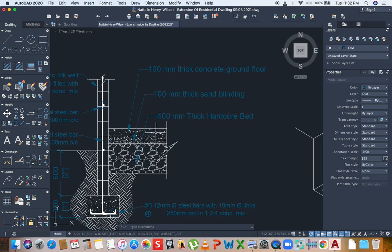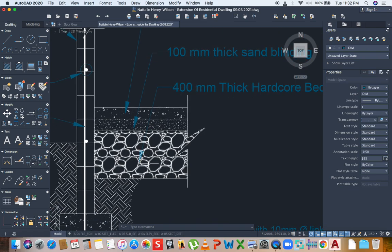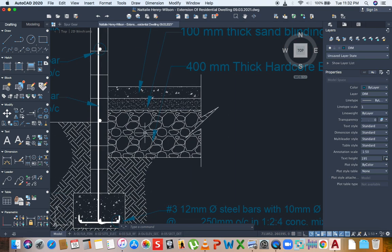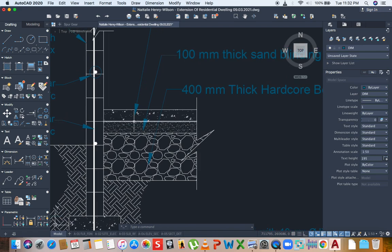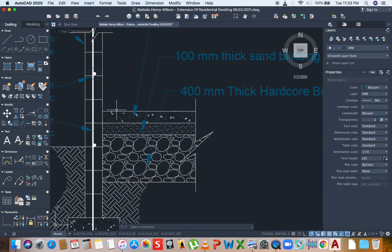the concrete slab. And sometimes on top of the sand, you will have the damp-proof membrane, because the hardcore tends to be a bit more porous, meaning water can travel through. So if the earth is saturated, there's the potential of the water to seep up, causing leakage in the slab, or moisture that can cause the growth of algae and so forth on the ground, molds and so forth. So you'd install a damp-proof membrane to take care of that issue, to prevent the moisture from going up.